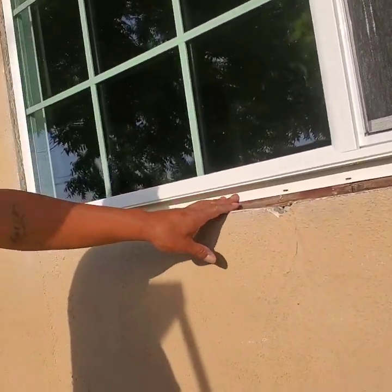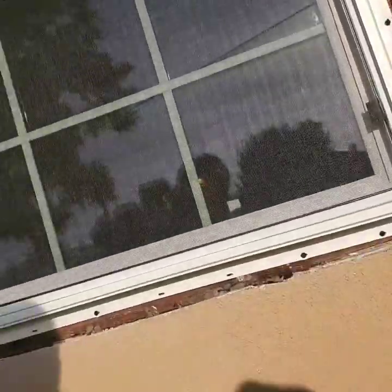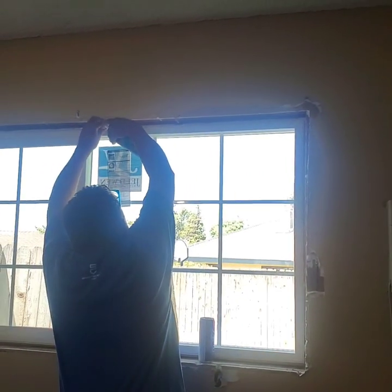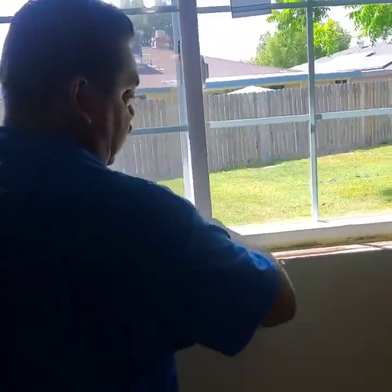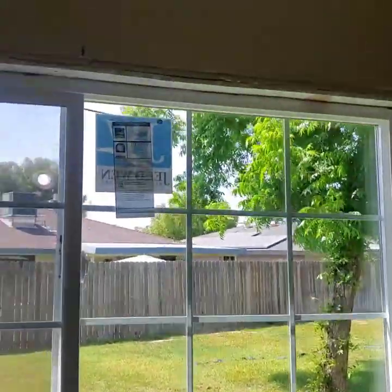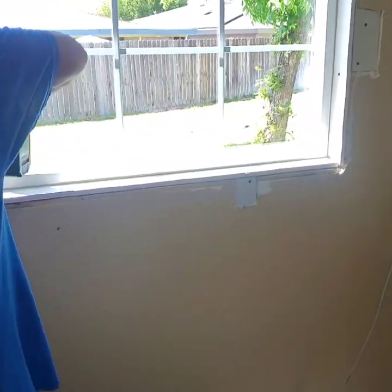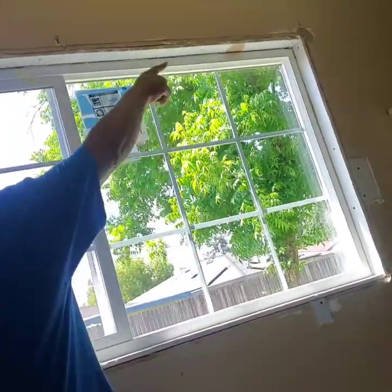Now what we have to do is put some stucco in here — I'm going to be doing that tomorrow. But inside right now, I'm going to go in and do the foam. We have to fill the gaps with the expanding foam. Now I'm working on my window sill — I already shaved all the foam off. I'm measuring it at two and a half inches, going all the way around with it. I got it on my window sill all the way around.